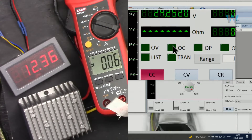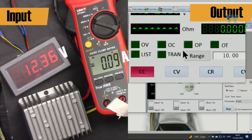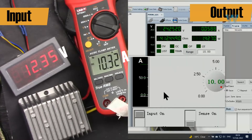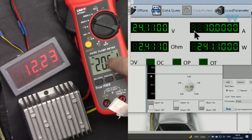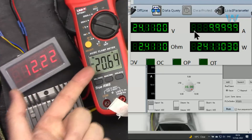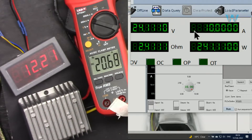Let's get started with the test. Input is 12.3 volts, output is 24.2 volts, current is zero. I've set the range to 10 amperes. Now it's supplying 10 ampere at the output. As you can see, the input current is 20 amperes — because when 12 volts converts to 24 volts, the current must double. So we're getting 20 ampere at 12.2 volts input, and 24 volts output. Very cool, no noise.